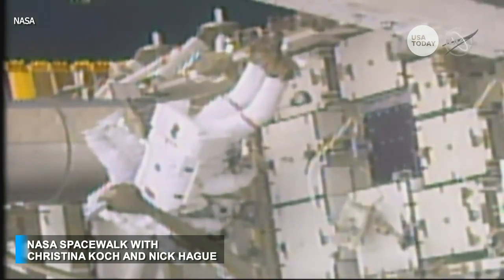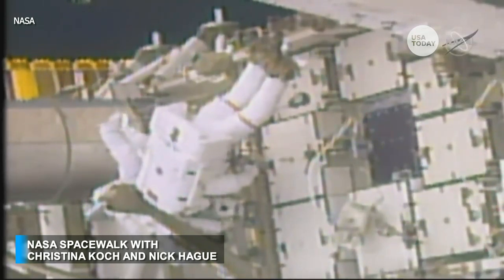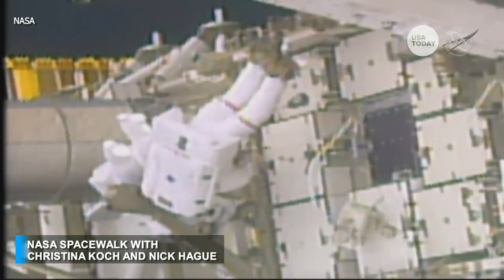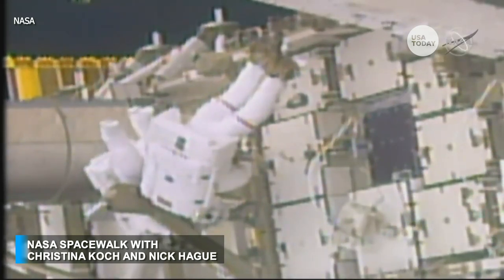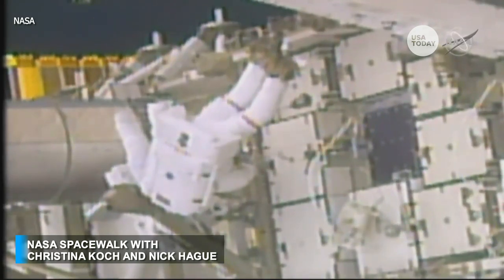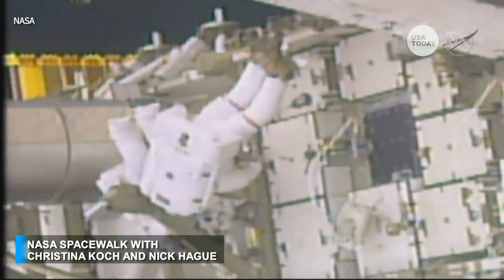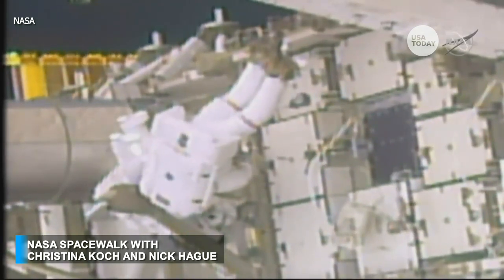Copy, and your settings on the PGT will be alpha 7, counter 2, and you may feel the bolt skipping if it's fully released, but not as much on the AP. Okay. Turning. Yeah, it's a very subtle skip. The lock indicator on the H1 is showing unlock, and it goes fully to unlock and then springs back just a little bit and then goes fully to unlock like it's skipping. So I think it's fully released.